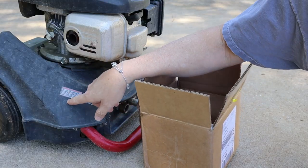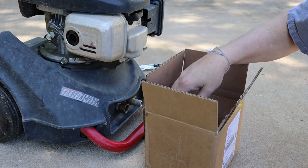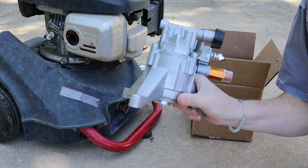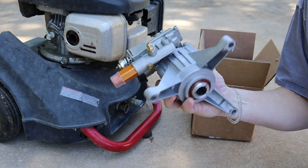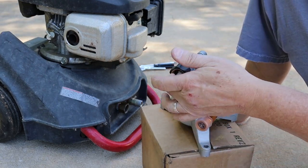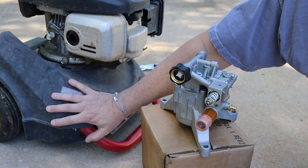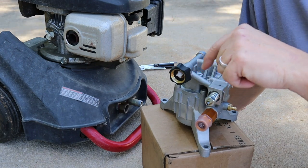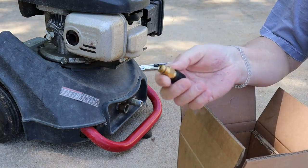Now the pump that comes with these pressure washers is a piston pump and they bolt on a lot differently than the replacement pump that I bought. I bought it online. It's one of these — they call it a vertical pump. You can get them online for about 80 bucks and it bolts on a little differently, using the motor bolts instead of the four bolts that the original factory piston pump bolts to. It looks to me like when it's installed, the hose connection for the water hose and for the lance hose is going to be a little short. So what I intend to do is take off the plastic shrouds, which I've never liked anyway on this pressure washer and just leave them off, which will make it easier to get to this. I'll leave a link below in the description where you can buy the same pump. It comes with some minimal instructions and a thermal valve that you have to install yourself.